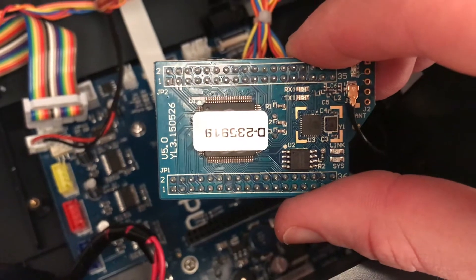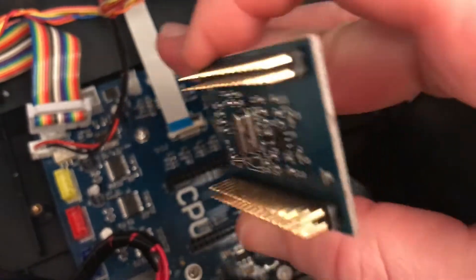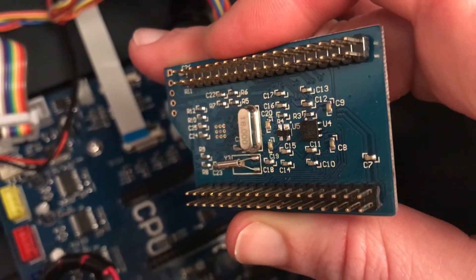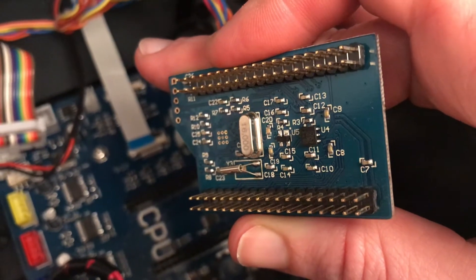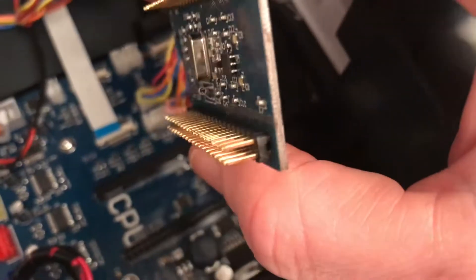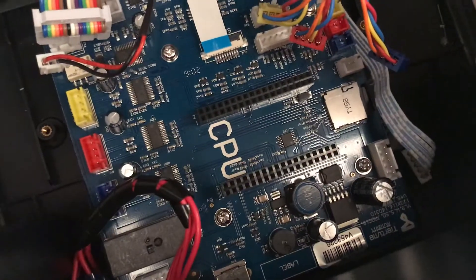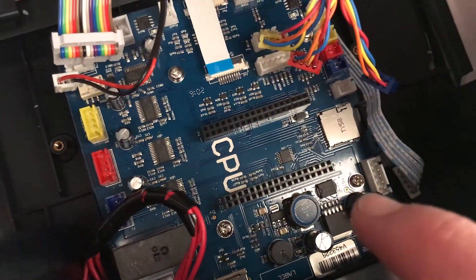If you watched last week's Five Minute Friday, I went through the process where I found out my extruder motor wasn't working. Tier Time sent me a new board, but for all I knew it could have been the tiny little CPU mini board which could have been the problem. Bear in mind that the main board and the CPU board are ordered separately from the parts supplier, or if it's a warranty call make sure you mention that to your supplier.